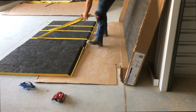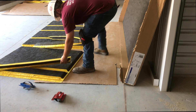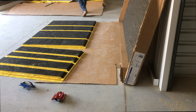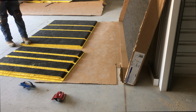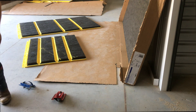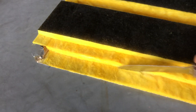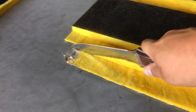You've got to remove the V-grooves and the two pieces for the shiplap. Always make your job easier — try to get two pieces out of a duct if you can. Cut it while you're on the ground; you don't want to have to set back up and cut again. Now I have to fillet the duct. After you cut with the shiplap tool, sometimes it'll leave a little bit of extra, so just score it down on the flap, and then you're going to want to fillet it.